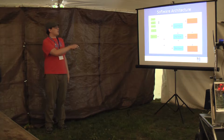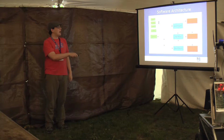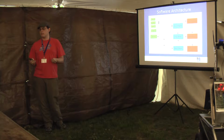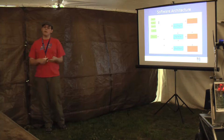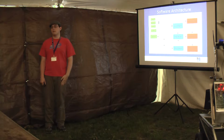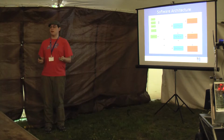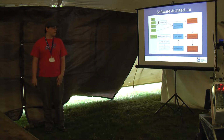The end goal of the system, through the vision system, which Ken is going to talk about in a moment, and this laser mapper, is to build 2 occupancy grid style maps: one with the laser scanner, and one with a simulated laser scanner based on analysis of the camera images. We merge those into a single occupancy grid map and do path planning on it. Then we use both the map and the laser scanner to do path following on the path we just generated.